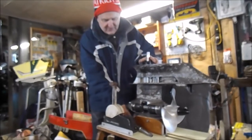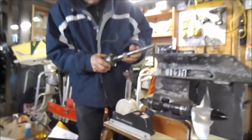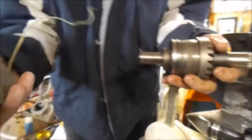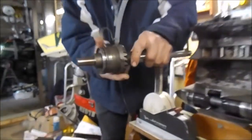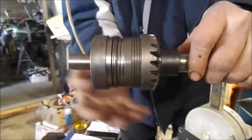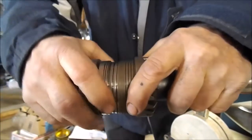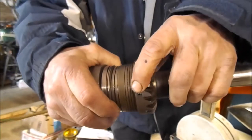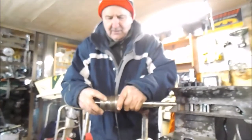We've got here an electric shift lower unit — the first one OMC came out with in the mid-60s. It has an electric coil at both ends, one here and one here. It looks like a coil of wire. If you look, you can see that the gear spins but the inner part does not. When you shift it, this electric coil pulls this piece tight, having them both turn together.